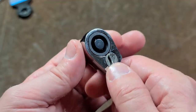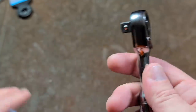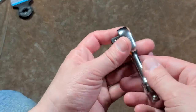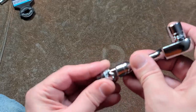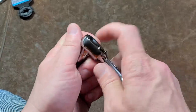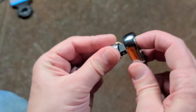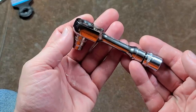When you have your hands on it in awkward situations, I think that's actually pretty wise engineering — you're less likely to accidentally hit the reverse lever when you're using it. I like that it has a square on the end because it gives you several different options. Say you're working with 12 and 10 millimeter fasteners — much easier just to keep the spare socket right there at the end of the handle, makes it a little more comfortable, and when you need to swap, super easy.